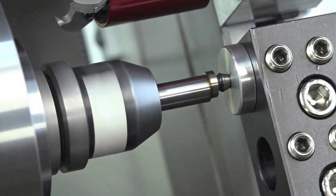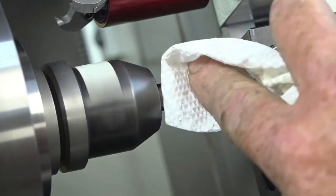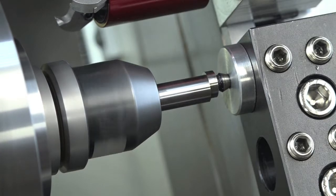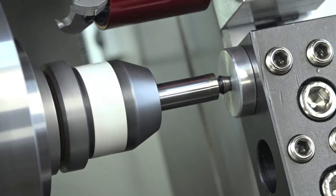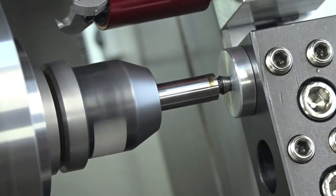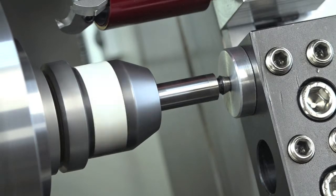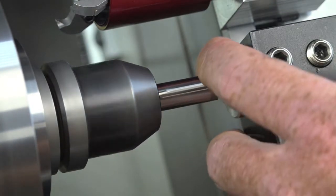Just until you see it stop — it just did but I backed it off. A little bit of oil on here, I'll clean that up. A little jog down. Generally I'll just run my finger over the edge to see if I can catch my finger on it.